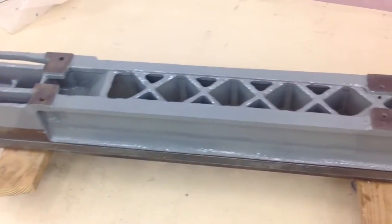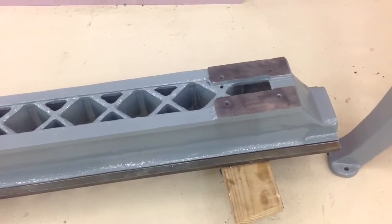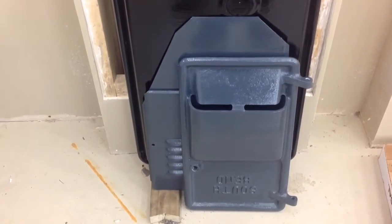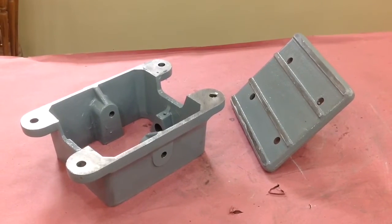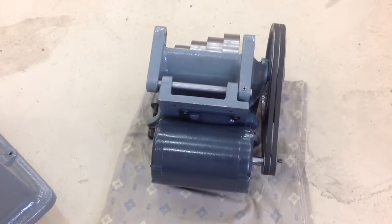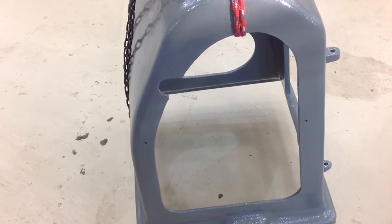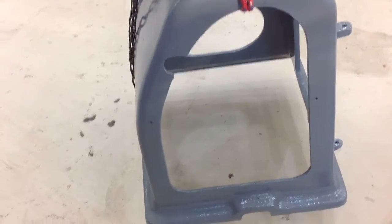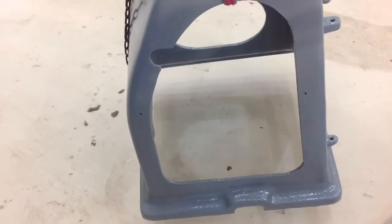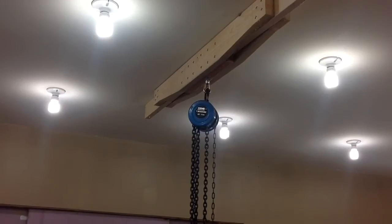This is the bed. It's upside down in this photograph. There's the back legs and the chip pan. This is the short leg. The first problem I found was that this motor assembly will not fit in that hole — the motor will, or the cone pulley will, but not both. But they will fit in the hole underneath it.